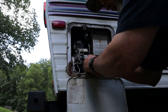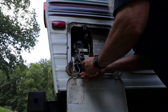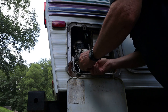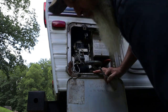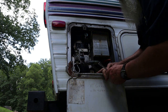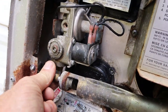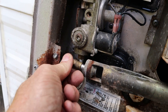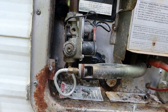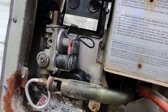Of course there are only two screws in this heating element cover because nobody ever puts the hard one back. Oh, actually the third one is in there — well isn't that special. I just noticed something: the gas line is not even hooked to the burner assembly. Somebody had that line off and never put it back. I'm going to get the burner assembly out of my way so I can get to the heating element.